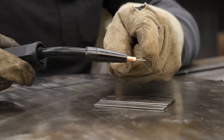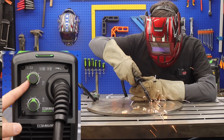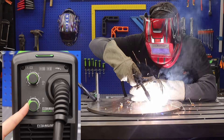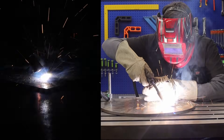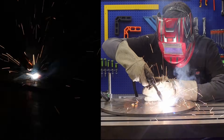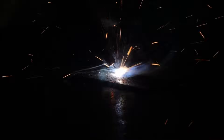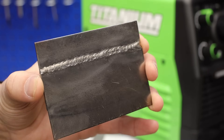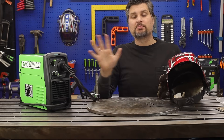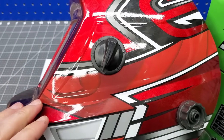First up is some 16-gauge plates and I'm going straight off the suggested settings, which is C and 4. This is the actual speed that I'm moving. With a lap joint on thinner material, if you start burning right through, turn the settings down or move faster. If you start welding and it is way too bright, make sure you crank up that shade. I did up my amperage so now I'm going to go to about shade 12.